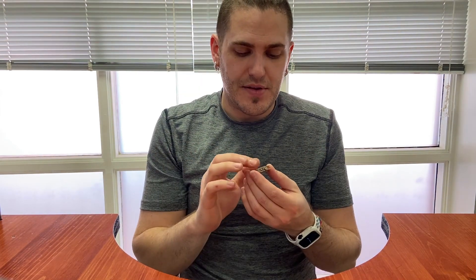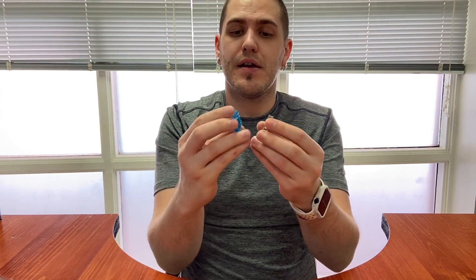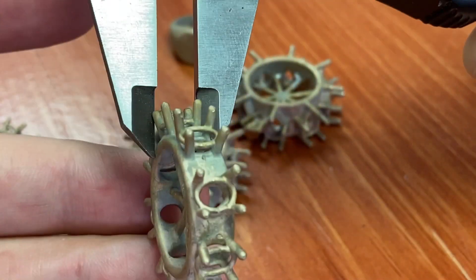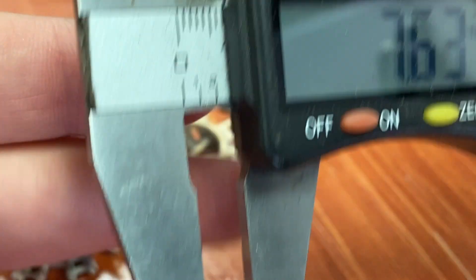These casts turned out really, really well — cast in silicon bronze, a material I'm very familiar with. There is absolutely no surface texture on them that wasn't already in the print; a little from supports, but that's totally normal. There is no sign of thermal expansion whatsoever, no flashing, and everything is exactly dimensionally as it should be. I have the print version and cast version here and they are the exact same size in every possible way. Shrinkage is not a big deal — though bear in mind that will vary between metals.